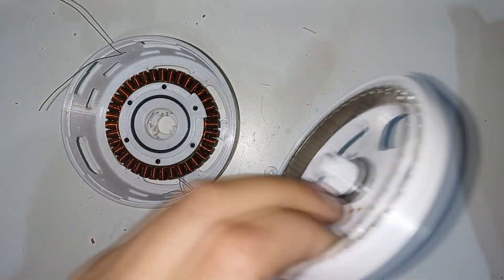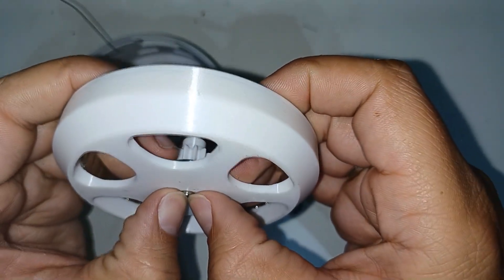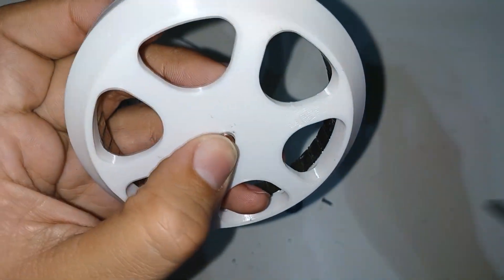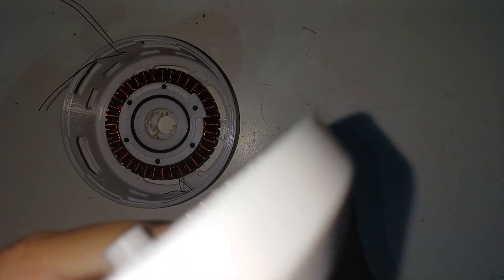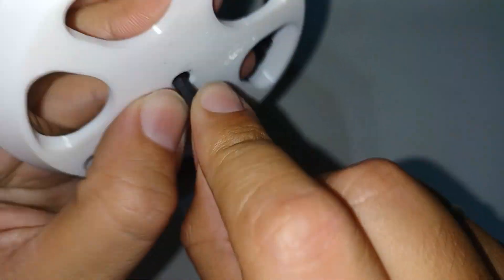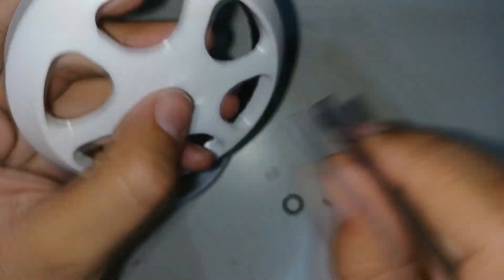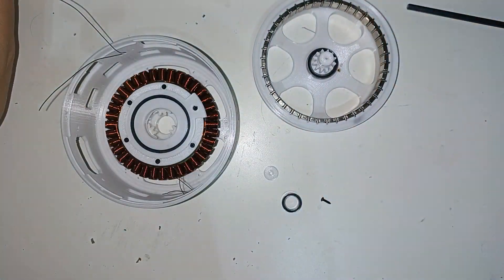The magnet is inserted into the rear of the rotor. This magnet, along with the magnetic encoder, tells me how many turns the rotor turns. The rotor does not have an external steel casing like conventional BLDC motors, which results in lower torque output. That is why I had to introduce the Halbach Magnet Array mounting 42 large magnets and 42 small magnets. By doing this, I have managed to decrease the lack of torque from not having a steel outer ring.